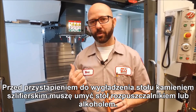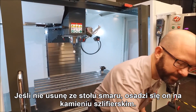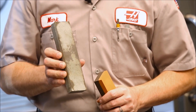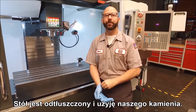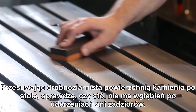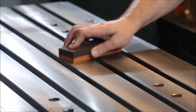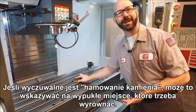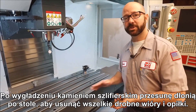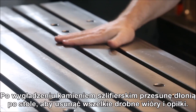Before we can stone the table we have to clean it with a solvent or alcohol. If we don't get the gunk off the table then that gunk is going to load up our stone. Now with a gunk-free table we're going to break out our stone, and using the fine side we're going to check for dents and knock down any burrs that might be there. If you feel it catch on something, that might be a high spot we have to look at or a chip we've got to break loose. When we're done stoning I like to take my bare hand and just wipe away any swarf that might be there.